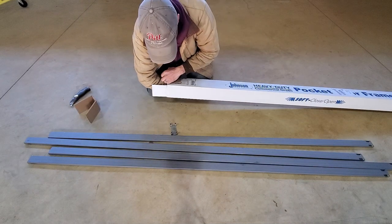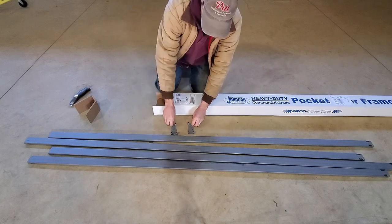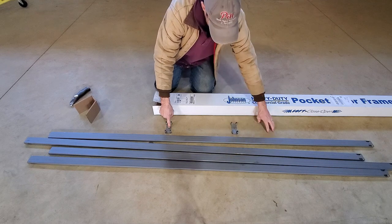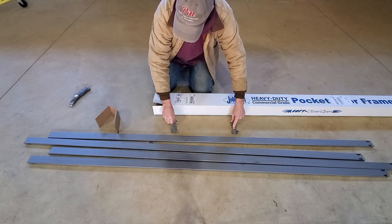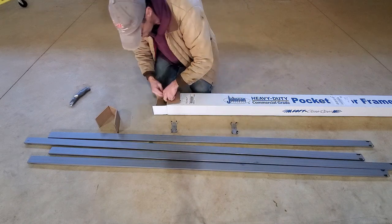Those are your floor brackets. So between your wall and your opening, your pocket door is over here. This is where the first bracket goes. This one goes halfway in between — this is your wall opening. This will go halfway in between your wall opening and your last bracket before you hit the actual door itself.